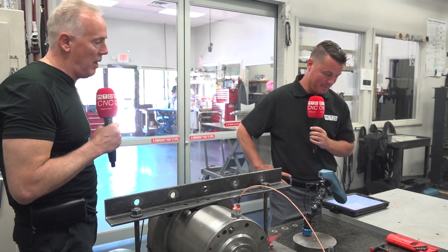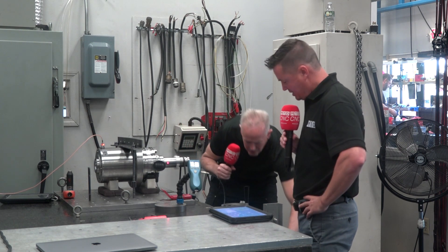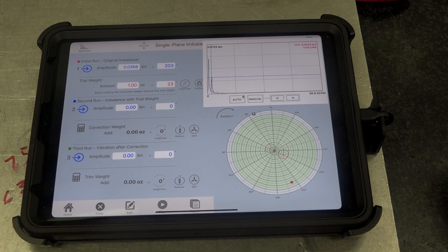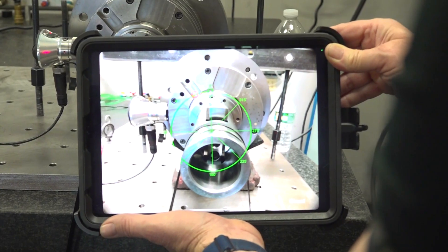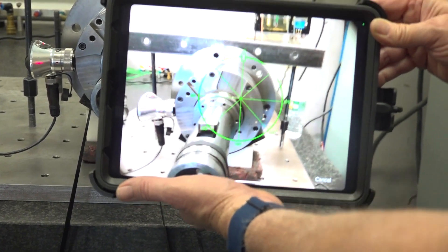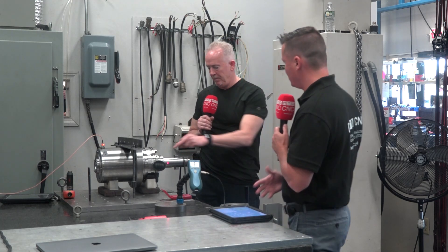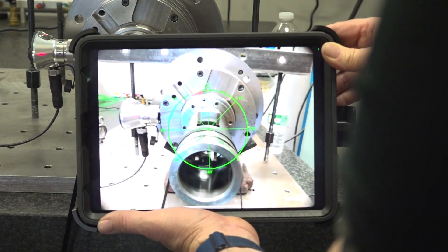Press that number one button and tell me what the next line says while I shut this motor off. It says add 0.02 ounces — the amplitude is 0.04 — at 23 degrees. There's also a cool feature where you can hold the iPad up to our 12 o'clock position and look through the camera to see exactly where to place the screw — right through the camera. Impressive.